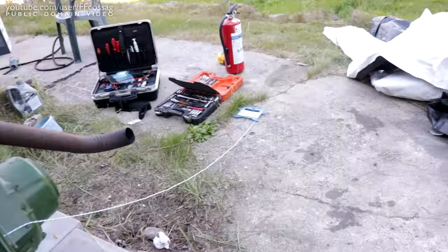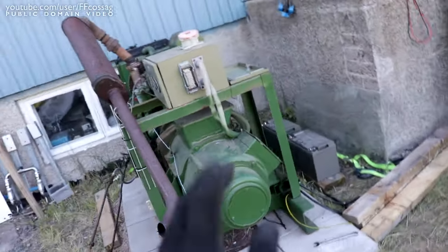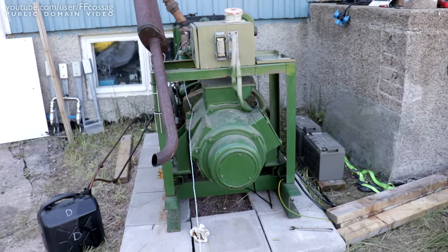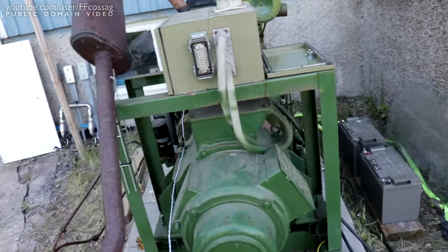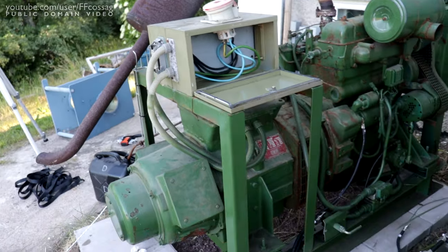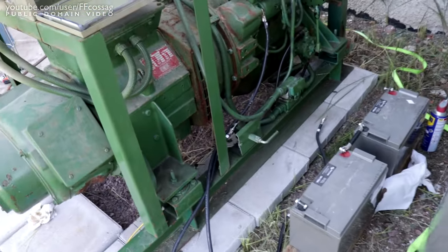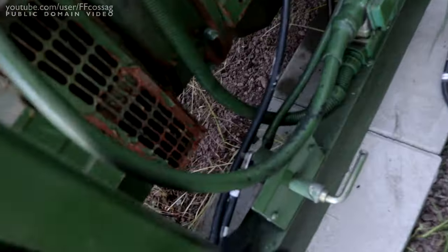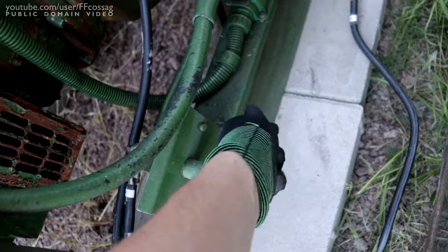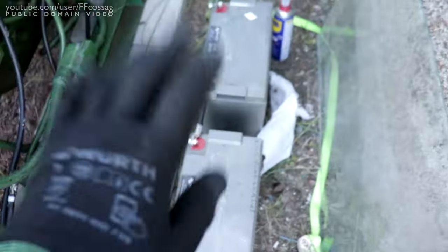That goes to a plastic string just in case something's gone horribly wrong with the generator during winter, as it's just been sitting around. You don't know what moisture can do to these things — it can very quickly get very ugly. I've also wired up some slightly better starter cables. We have just basic crimped 50 square millimetre wires going to the main on-off switch.